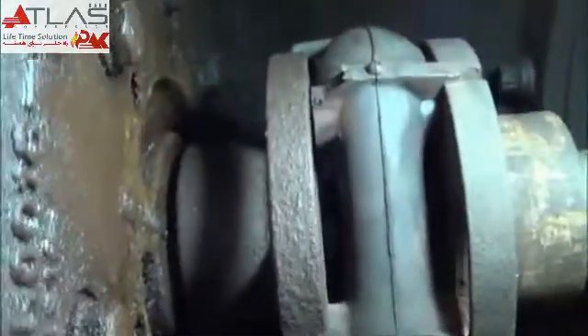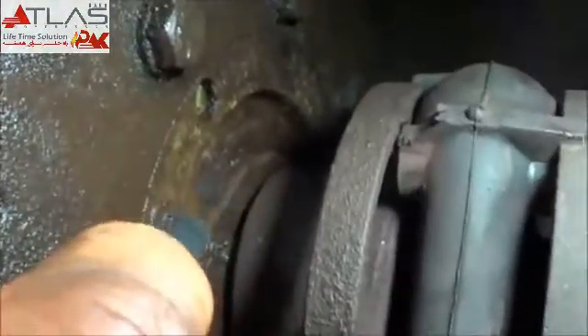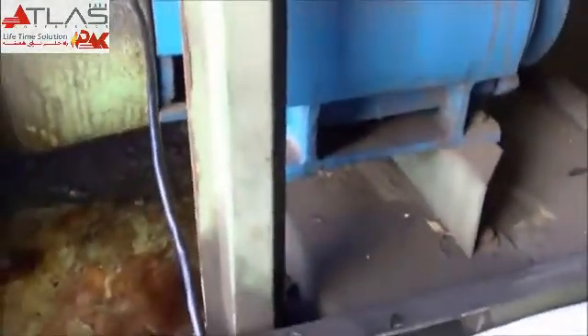Got all the coupling bolts out. It's a pain in the ass, really, because you've got a small clearance area right in the back side, right over here, where you don't really get the bolt out. That's why they've got this little indentation of the seal area right over here. But at any rate, you've got all the bolts and the bell housing on except for one. I just got to kind of block up the motor and slide it apart.